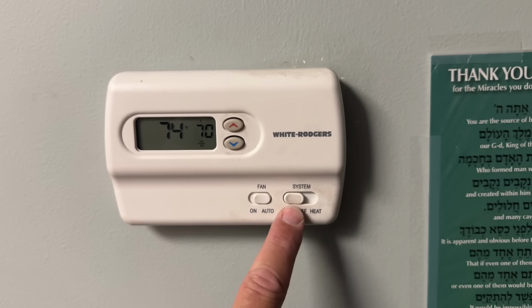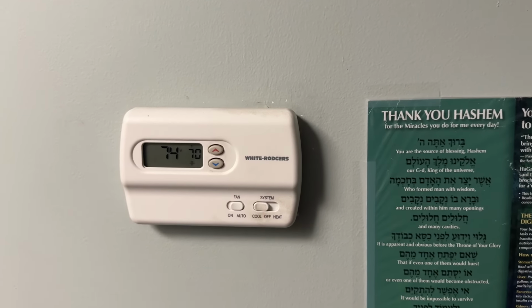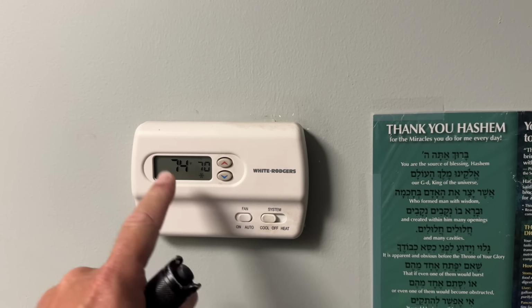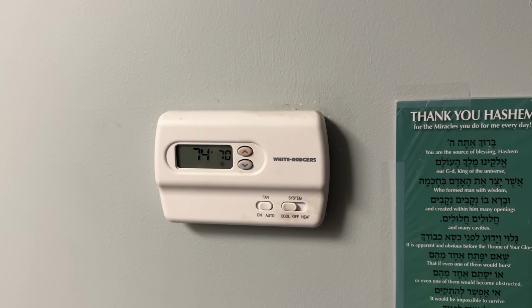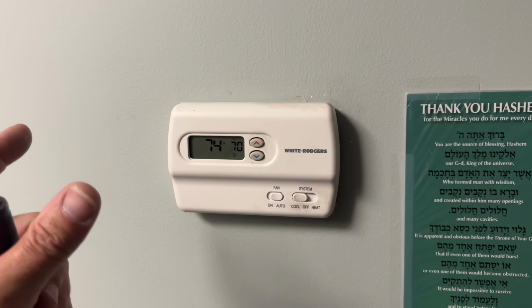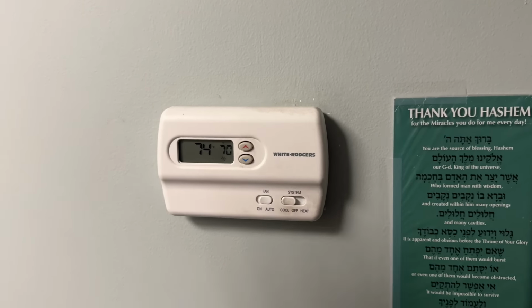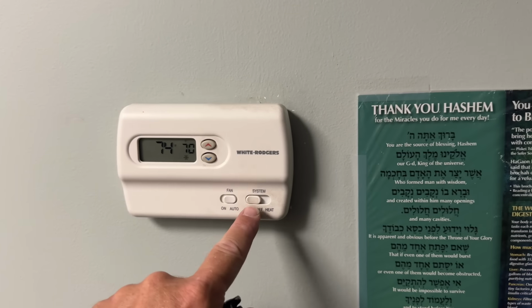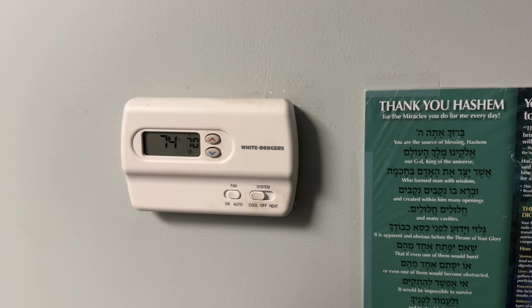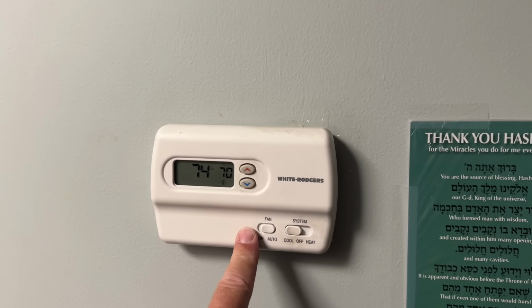All right, so I just turned the switch from off to cool. I also power cycled the furnace. There's no service switch on the furnace, so I just opened the blower door. The door switch opened, killing the circuit. So the circuit is opened, power went off, and I put the blower compartment door back on, and the unit was quiet. As soon as I put the system from off to cool, the blower behind me in that staircase turned on, but there's no condenser running on the roof.